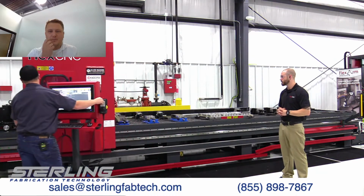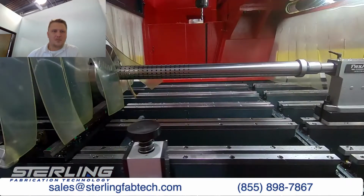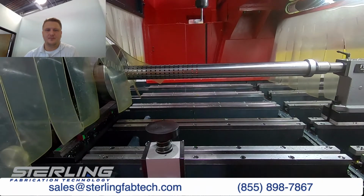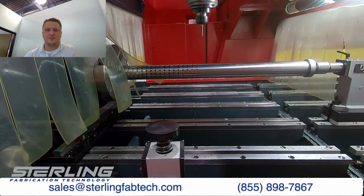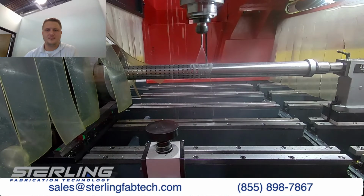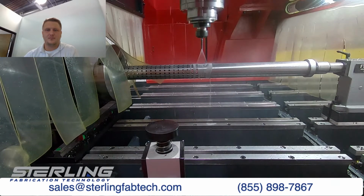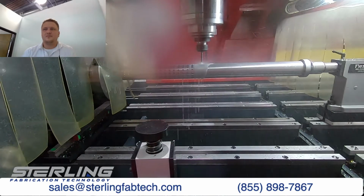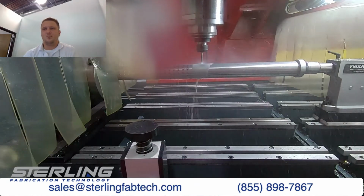Yeah, so right now the setup that we got here, I've got the tailstock that's giving the piece a little bit of support. The part that we're running isn't anything long or crazy. So as far as needing any support throughout the part, it isn't really necessary. The tailstock is enough to keep that part secure while we're drilling these holes here.